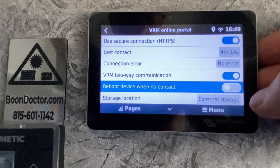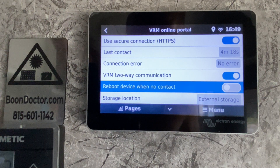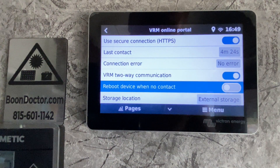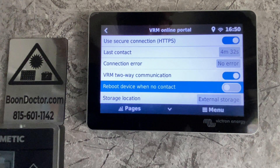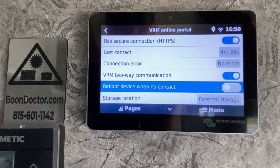If you're using Wi-Fi and you're going to leave the device alone, you can enable the auto-reboot feature — make it blue — and it will give you the ability to set the time frame, from one hour to 24 hours offline, before it reboots and tries to rejoin the Wi-Fi network.